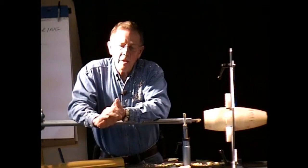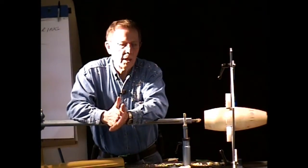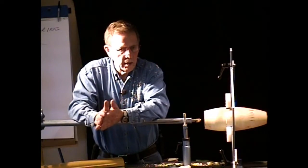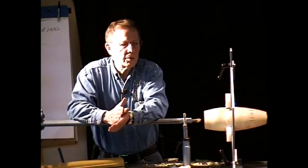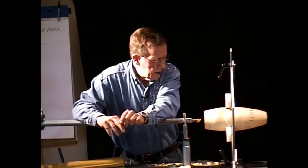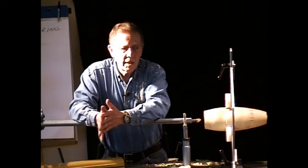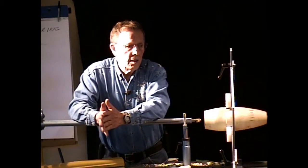If you have the right kind of sharpening equipment and you're really careful about it, you can put a new edge on that carbide too. You need a diamond and a very, very light touch, because if you cut just a little bit too much off, way too much of that edge is gone. It is possible to resharpen it. High-speed steel is easier to resharpen, but if you do a lot of hickory like we do, hickory takes the edge off of high-speed steel in a hurry.